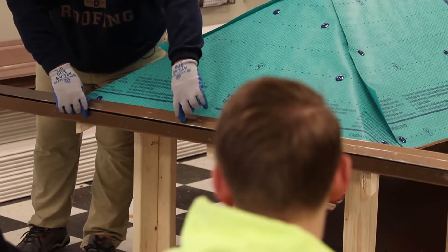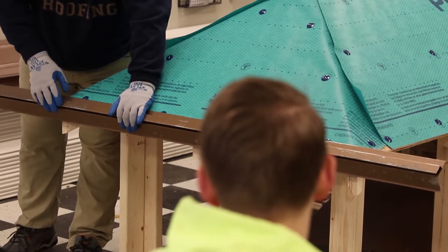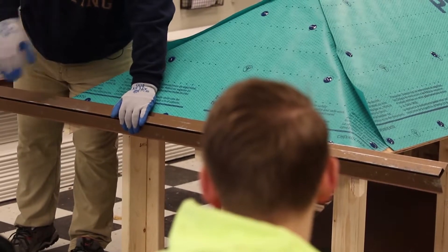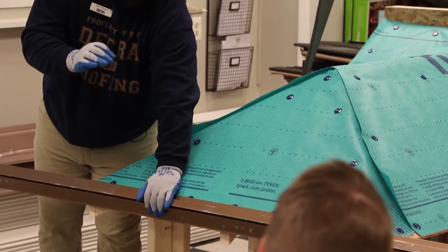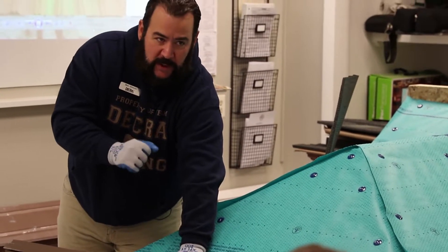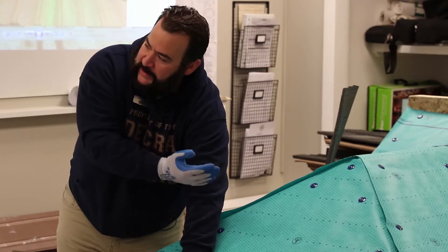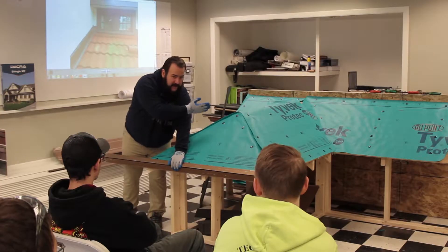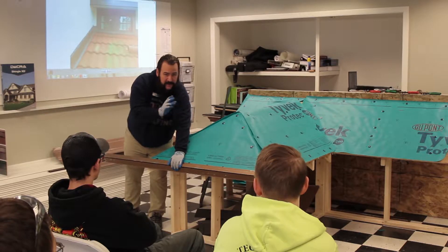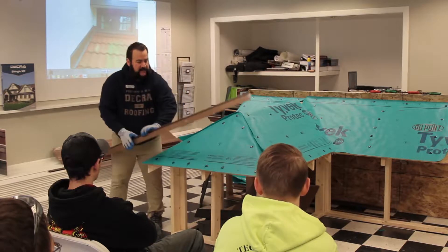You may be touching here, it's going to be floating there, not touching there — it'll be touching back on the other end. It's pretty critical to make sure you've got a nice straight line when you're starting this roof. Because unlike comp shingles, you can't choke up courses. You set that first row and everyone hooks and locks into that. If you're crooked to start, it's going to be crooked in the field — sometimes it gets exponentially worse as you go up.